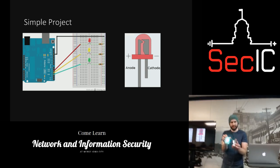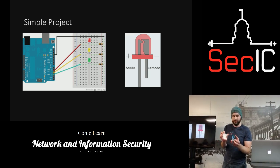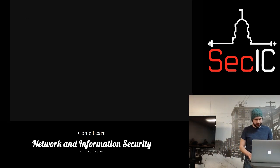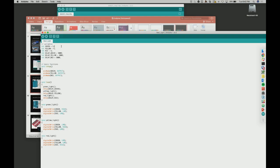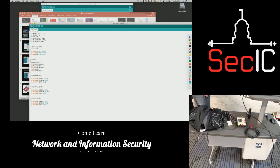This is just set on a timer, so it keeps changing. This is the code — you show all the variables: green is pin 3, yellow is pin 4, and red is pin 5 on the board, just to keep things in order. These are the delays for each color. Then in the setup you set what each light does — high is on, low is off. I'll make everything high so everything should turn on.